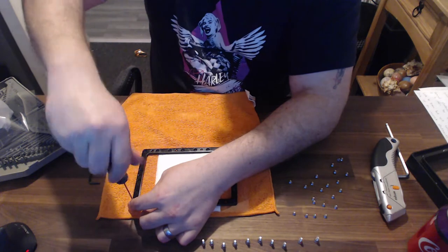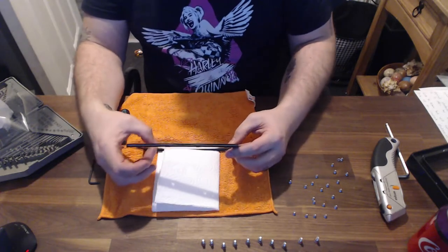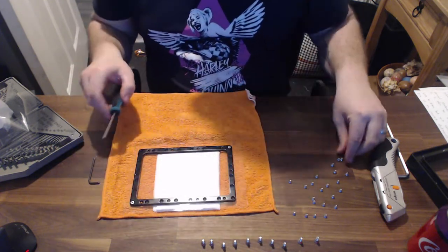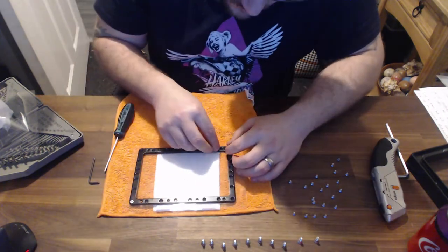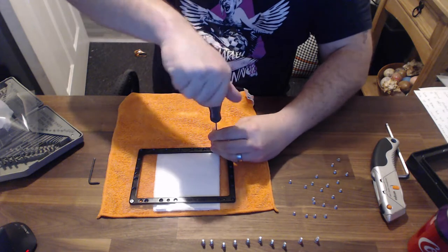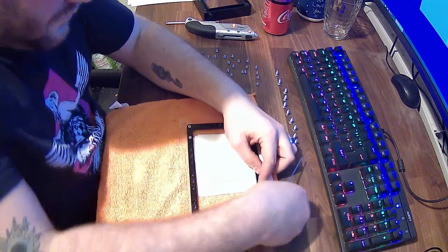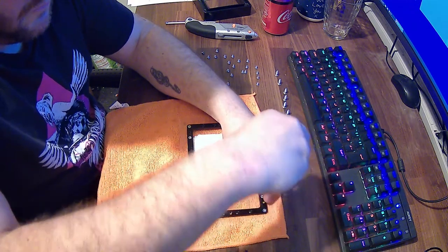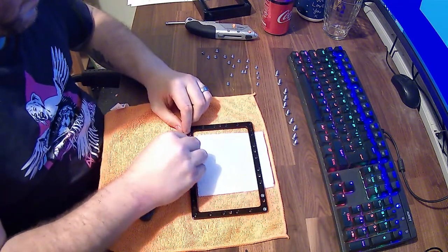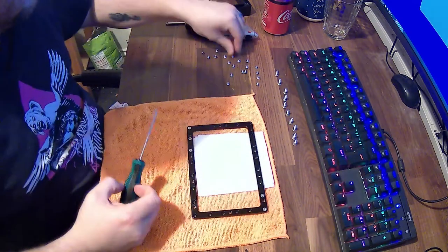I do find a little bit of pressure and they just pop straight through — you can screw them up no problem. I'm just checking there's a little bit of loose tension there; it's not as loose as I'd like but it will do the job for a good while. I've got a couple of big prints coming up — like the Babylon 5 pistol that I'm going to do in resin and a couple of Sanex models — and I want to get into the habit of changing the FEP a little bit sooner. I've left it almost a year and I'm just starting to see some print fails.